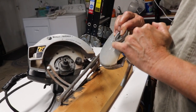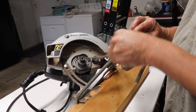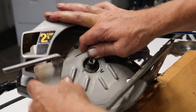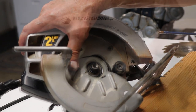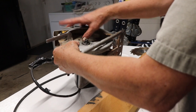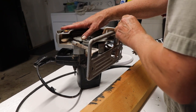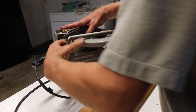The spring has this little end on it that needs to fit into this little groove right here. It's only going to go in if you rotate the guard far enough counter-clockwise. It's only going to go into that little groove if you remove this bumper, which takes a size 30 Torx driver. Now I can rotate the guard all the way counter-clockwise — and boom, I heard the spring snap into that little groove. Now sure enough it's working, so we've got that fixed back together again.